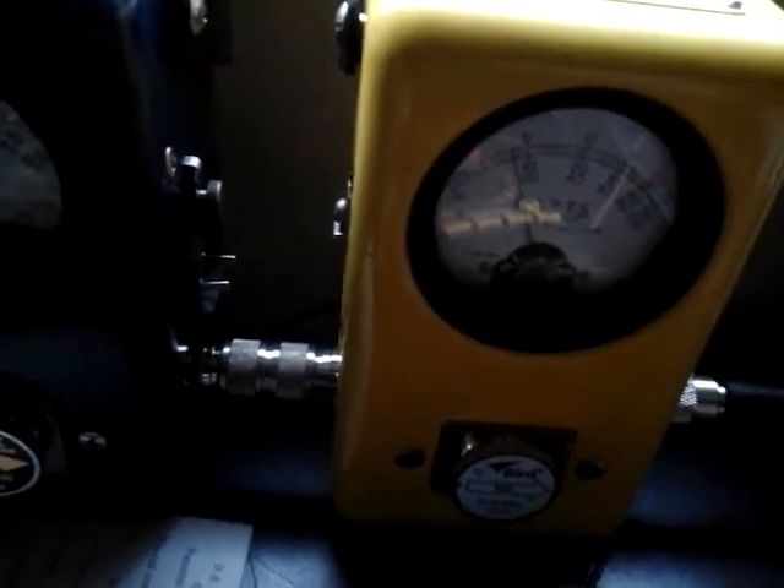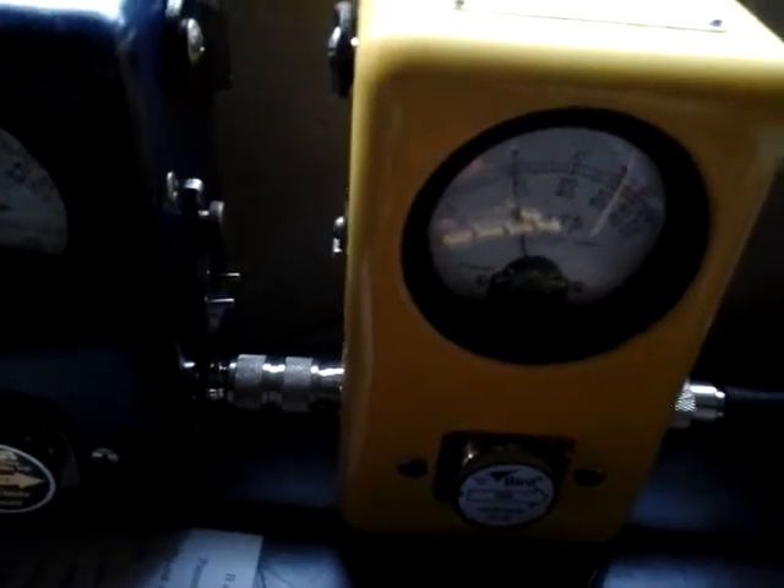There it is, 200%. About 8 watts peak, I think. That's right there, buddy boy. 8 watts peak at 200% modulation. That is correct. 4 watts from a 1 watt carrier is 100%. 200% is 8 watts.